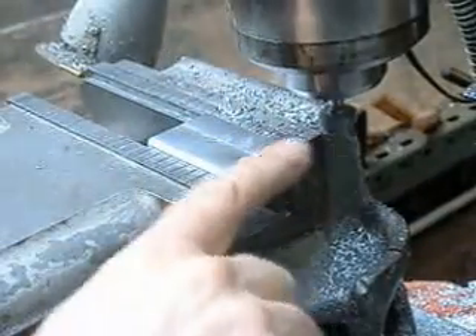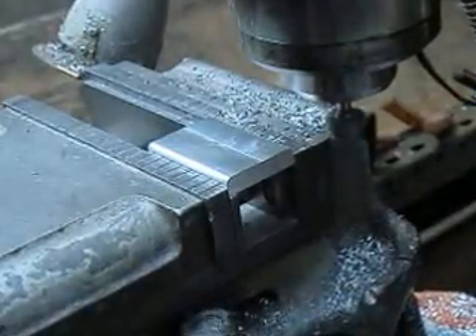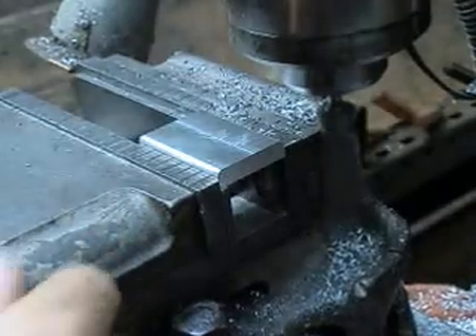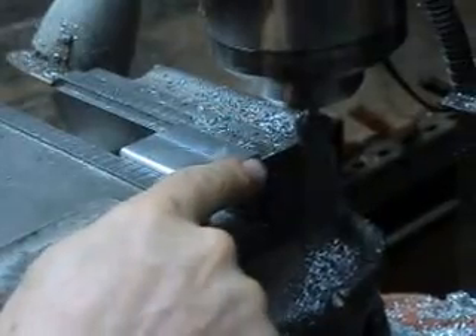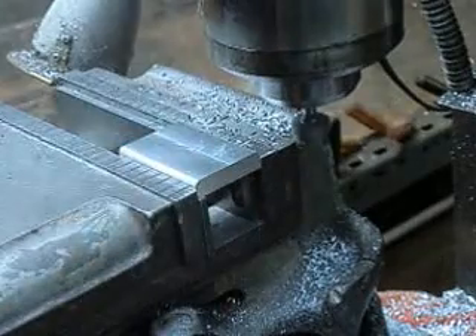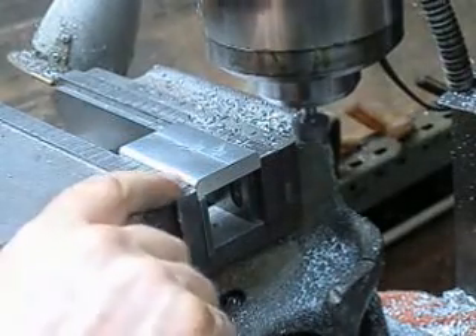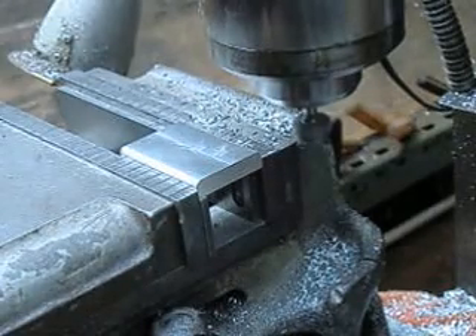What I've done is come in with a router bit — of all things — trimmed down the face of the router bit and got rid of the bearing, because I really don't need it here. Here are my bearings, here's my solidity, and now I'm going to run the router bit across this edge here, because I didn't have a radius edge mill bit. The router bit seems to work just fine, and since it's just such a small radius, I don't think I'm ever going to use it for wood.